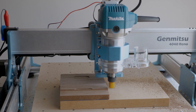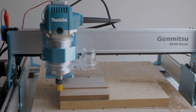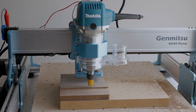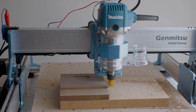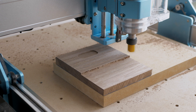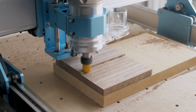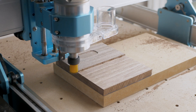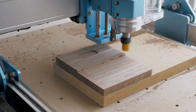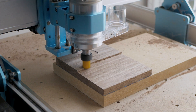When it comes to things I don't like, it's hard to complain for the price, but I would have liked to have seen dust covers for the Y-axis as you need to keep them clean for the motion system to continue working. I would have also liked eccentric nuts for the V-wheels to really tune them in and slow down the inevitable wear and tear, but along with the belts they should be considered as consumables. And of course a probe mount would have been nice — link in the description to print your own. Hope you found this video helpful, and if so a like or subscribe would really help the channel. Any questions just leave them in the comments below. Thank you for watching.